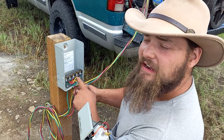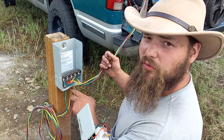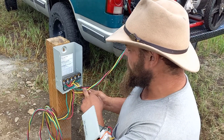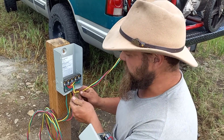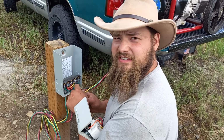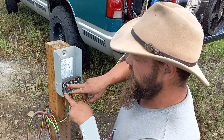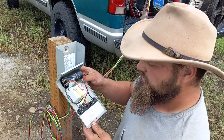Now, to power this, I've decided to power it with 240 volts. And so I need a ground and I need 2 hot leads. So I don't need the yellow wire. So the yellow wire is sitting here bare just to kind of scare you a little bit. And this is just a temporary generator set up right now. It's functional, it's waterproof, and it's working. And that just hooks up the black to L1 and red to L2, and I believe you can mix those up and it doesn't actually matter that much. Don't let this scare you.